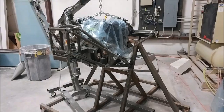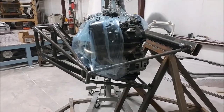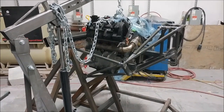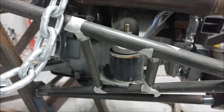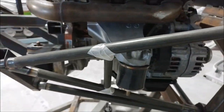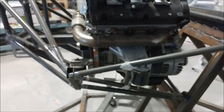Moving back to the engine — this has pretty much become one of my projects now. I've got the engine mount bolted up to the stand and the engine hoisted into place, held by the hoist. The rear engine mounts are bolted up as they were part of the mount design, but the side engine mounts on the Audi engine are in completely different positions on either side. It wasn't possible to design their exact locations in CAD, so now that the engine is in place I'm creating the plates and getting the vertical tubes positioned. It's fitting pretty nicely and we'll tack everything in place for Brit to weld up.